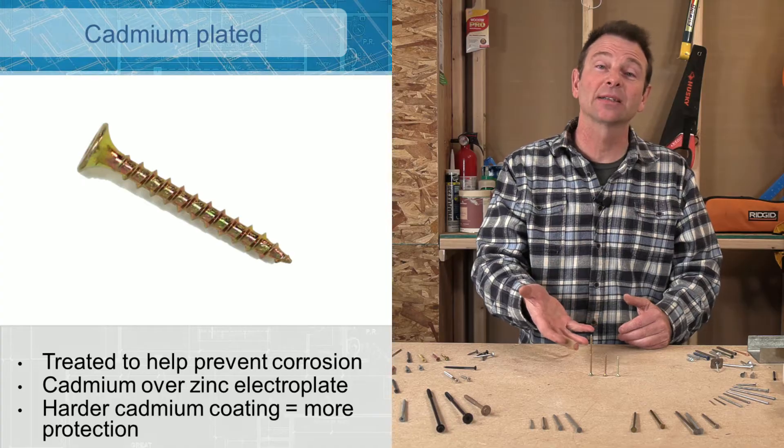Along these lines of choosing the right fastener, let's go through some examples. Here I have a two-by material, which is inch and a half, and I've got 7/16th OSB. I want to fasten my OSB to this base material. I've got three different screws here. Of course, we have our bugle head, which is going to level out with the top of the OSB. Code tells us in a lot of situations we need at least an inch of bite of that screw into our base material. Here I have a two-inch screw, which goes clear through my 7/16ths, through my inch and a half, and almost comes out the back of this two-by. The one in the middle is just perfect — the right choice for this application, and I get just a little more than that inch of bite into the base material.